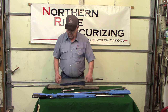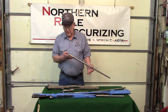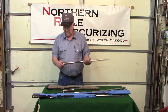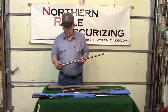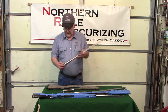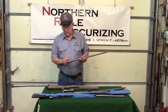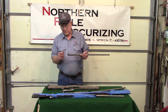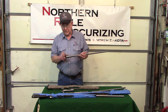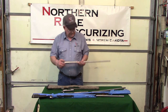Most of the barrels we get are basically a big piece of pipe with a hole in it. What we do, we blueprint the barrel along with the receiver. We take and redo the barrel to make sure that the outside of the barrel is concentric with the center line of the bore. We take and cut the ends off, put in new centers, and then turn the shank so that it's perfectly concentric.